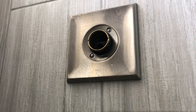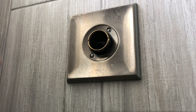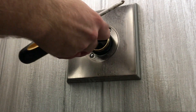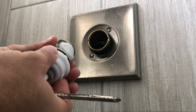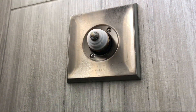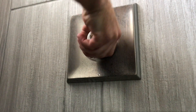So the old one had these two tabs with two notches, and the old valve body had two triangular pegs that fit in those notches. The new one only has one square peg right there — but that should be okay. Going back to reassembly, we're going to get that square peg in. I wonder what that does — and it drips on me every time. I wonder if that's why the old one was leaking. I never noticed you could turn the valve body with that peg like that, so we might do a little troubleshooting here. Put that one in. This is your hold-down ring that actually keeps the valve body clamped in.